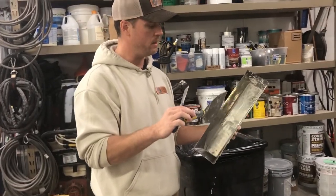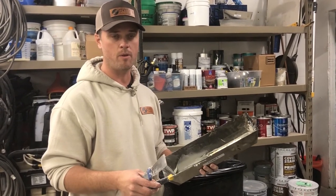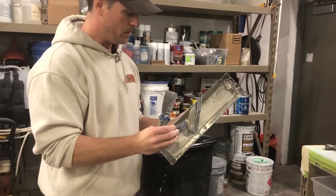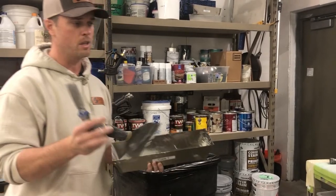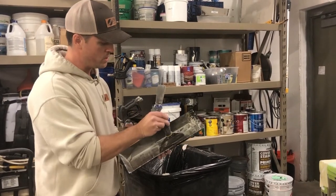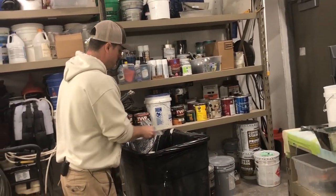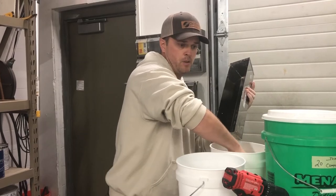The 20-minute mud I was using dried up on me — it's been 20 minutes and it's not really usable anymore. You might think it's clean enough to add more powder and water, but you can't do that. You've got to get this cleaned out really well every time, because residue will harden and drop down into your freshly mixed mud, making it bad. You'll get little hard pieces of rock dust in there, making muddying a lot more difficult and super frustrating. So make sure that every time you mix up more mud, the container is really well cleaned out — just clean it out with the bucket and sponge.